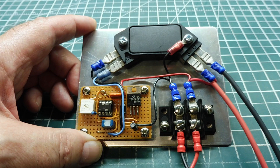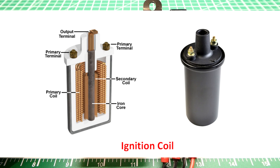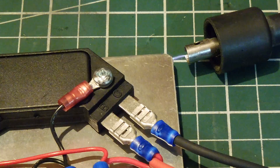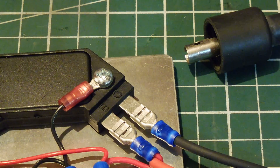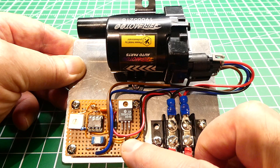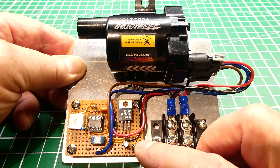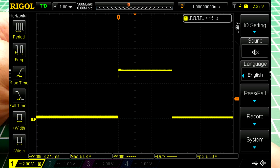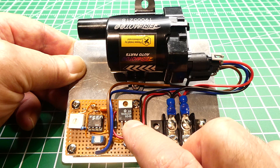In the past I made an ignition coil tester to test general purpose primary/secondary type coils used in older cars, using an HEI module — that's a high energy ignition module from an HEI distributor — to drive the coil to create spark. I used a 555 timer trigger board to drive the HEI module. This coil tester has the same trigger board: a 555 timer that outputs 5-volt pulses with a fixed dwell of 3.5 milliseconds.